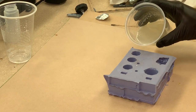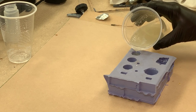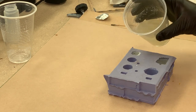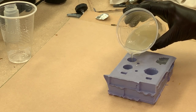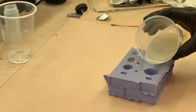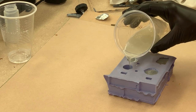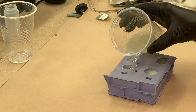We are ready to go. It's just a matter of pouring it into each of the moulds — you just get a little drip going. Now it does have some bubbles in it, but as it starts to warm up, the bubbles will start rising to the top. There are more professional ways of doing it, like reverse pressure, which brings all the air bubbles out, but for hobbyists this is more than adequate. When I'm pouring it in, I'm going just below the line of the lip, because it does expand a little bit. The more it hangs over the top, the more you get to file and sand off, which is quite often a pain.